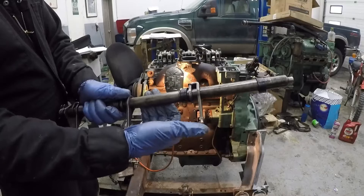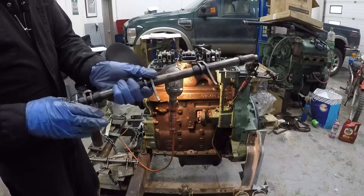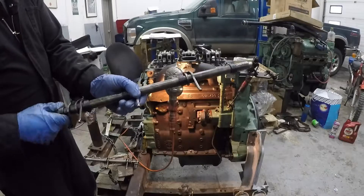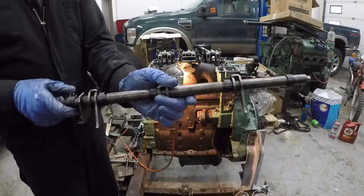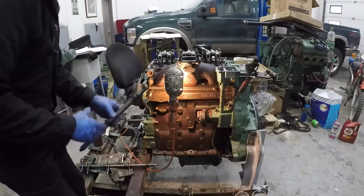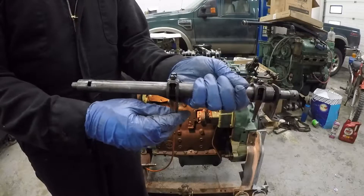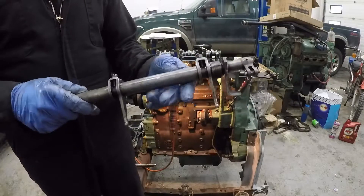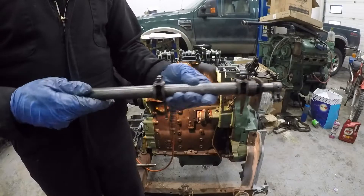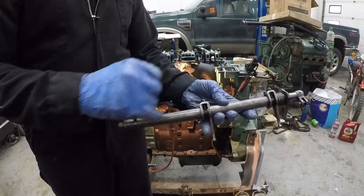The safety rack springs back like that, so in case one injector sticks the other two are free — the rack will still move with a stuck injector. The old standard rack has two screws, and if you've got a stuck injector on one arm, they're all stuck. So it's just a safety precaution I'm going to take. I just need to modify the tube slightly to accept the new rack fingers.